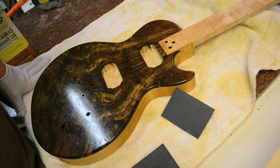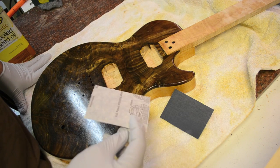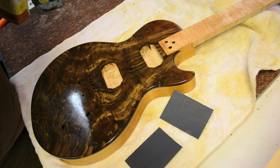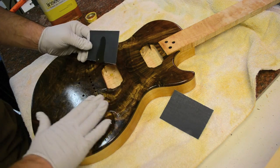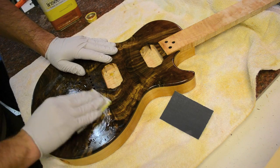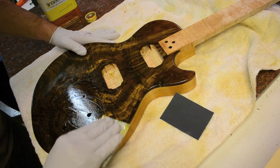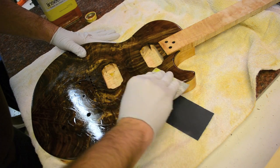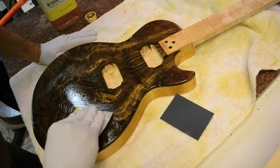When you can't get the TrueOil to sit very well on the guitar, you need to wet sand. What I like to do is get some waterproof sandpaper, either 320 or 400, cut it into squares, and then take some boiled linseed oil and sand with that. All you do is take a little bit, get the surface nice and saturated, and just sand. What this does is knock down any of the little things that are sticking up where it's not smooth, and you're going to get a really smooth surface. What's also nice is that what you're sanding goes into the parts that aren't filled in very well, so all those little particles go into the low spots and you end up with a really nice smooth surface.